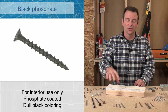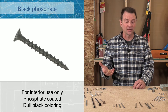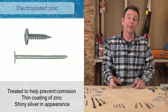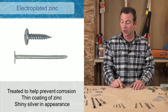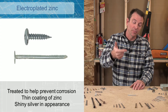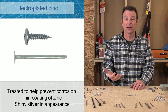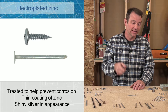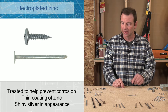If we need to use this type of general purpose screw or any fastener outside, we need to start coating it with something. This is where a metal called zinc comes in handy. We love zinc because it allows us to protect the steel underneath. Most of our fasteners are made of steel — that's where we get our strength — but unfortunately steel rusts fairly quickly. Zinc will coat the steel and will not allow it to rust.